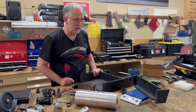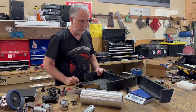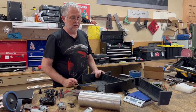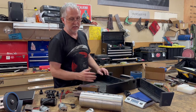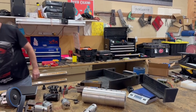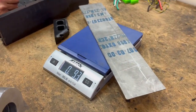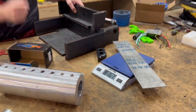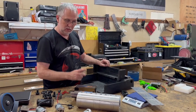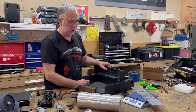The upside is I don't need to pull a full two pounds out of the weapon — more like a pound and a half. Well, yes and no, because I have to take into account the weight of the back panel. Taking off one pound eleven ounces and putting back on a pound and two ounces — so a net loss of near two pounds out of the weapon. We should be able to make weight at 30.